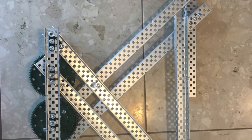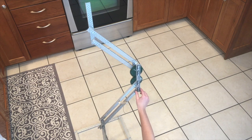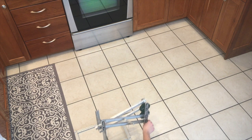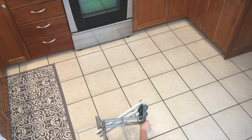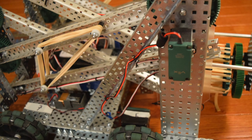The double reverse 4 bar uses two of these 4 bar lifts connected to gears, which means that when you extend one 4 bar lift, the other follows. This allows you to effectively get twice the reach while still taking up the same amount of space, as the lifts nest inside of each other like so, leading to yet another name of this lift: the bowtie lift.